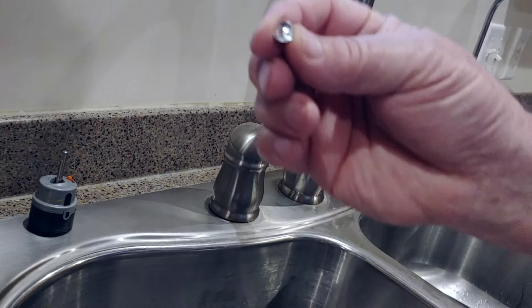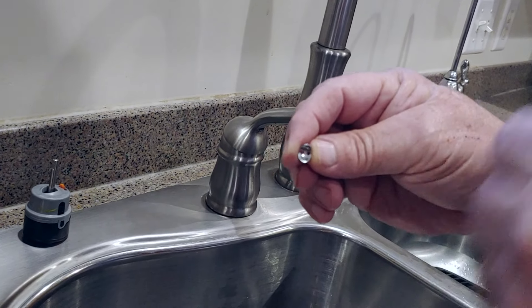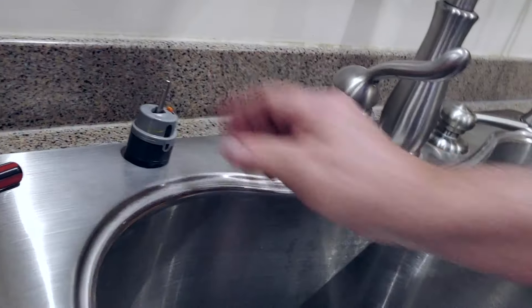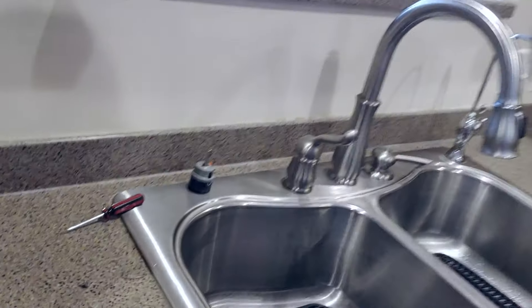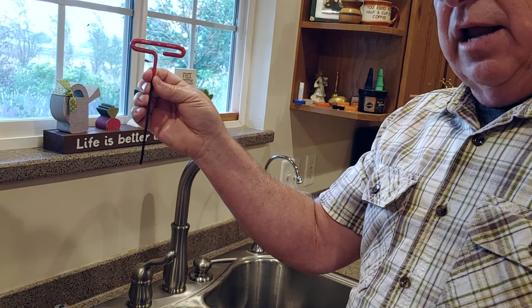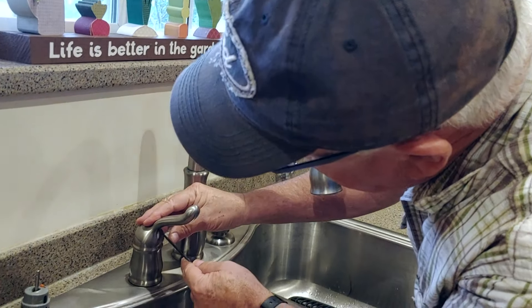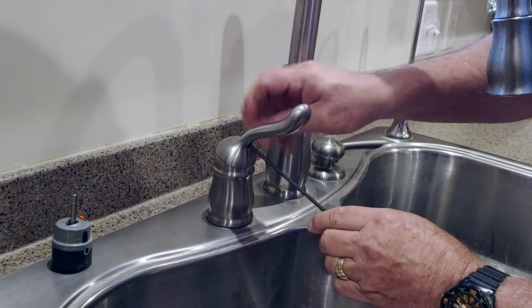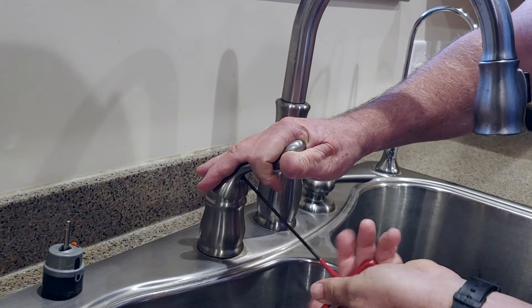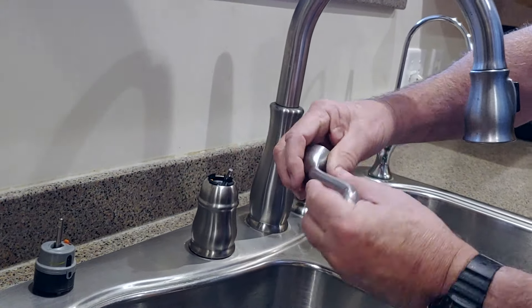As you can see, it's a little cover — red for hot, blue for cold, hot on the left, blue on the right. So let's go ahead and move that off to the side. Now you're going to need an eighth-inch hex key, also known as an Allen wrench. I like to use these T-handle kinds because it allows me to reach up there far enough. Put that in, get it into the handle set, hold on to the top, and undo it. You can see it's got some good bite. There it is — off it came. There's the handle.